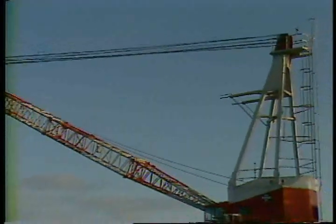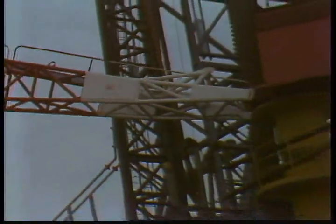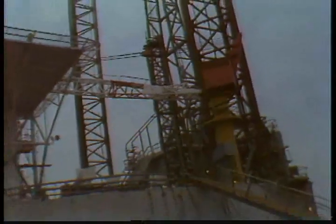There's a point you need to be aware of: if you're using the maximum capability of the crane at a certain angle and you boom down at all, you'll be overloaded. Both cranes on board are likely to have different length booms. Make sure the right load chart is in place for the number of boom sections you have on that crane.